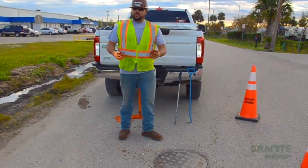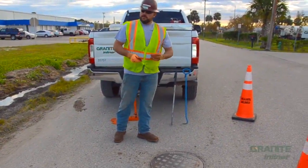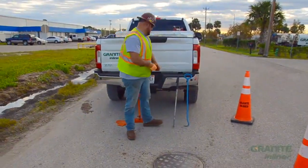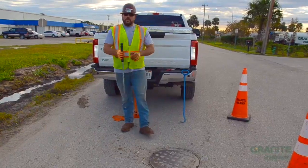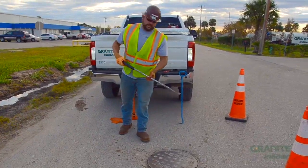When opening a manhole, do not use screwdrivers as a pry bar or chisel — they are fragile and have a high tendency to break. If you have a manhole stuck with heavy residue, use the appropriate rated pry bar to break the seal.